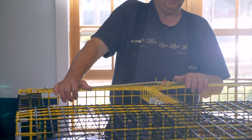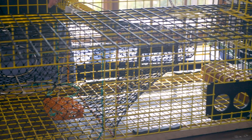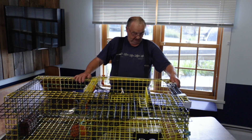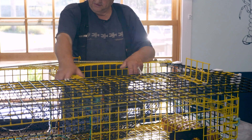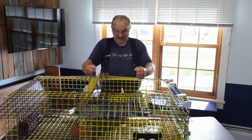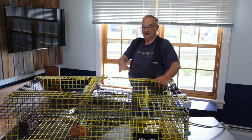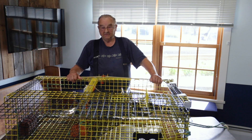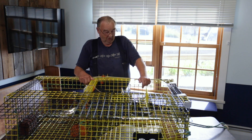Then it comes to the problem of weight — we've got to get the trap to sink. This particular gentleman has used bricks; he's got three bricks. Sometimes they kind of assembly-line making traps: one guy puts the bricks in, one guy puts the mesh in, another guy puts this in, somebody else is clipping these plastic corners on. They also put in what they call bridges — this is a bridge here, and there's one up here. That's for strength, to keep the trap from bending. It makes it strong when you're pulling on it. Some of these boats have got 18-inch haulers — a round winch that yanks them up. And if they're caught on a rock, something's going to give: you either get the hull, half of it, or a piece of it, or it'll break the line.